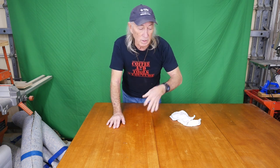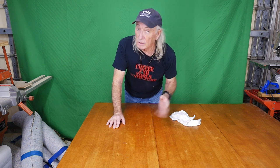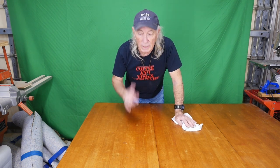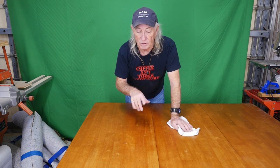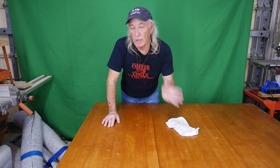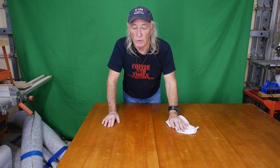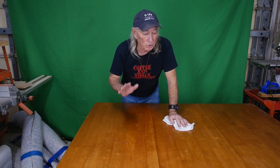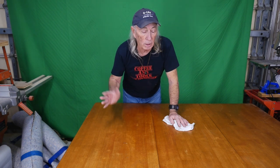There's no reason not to take something like this home, especially if it's free off the side of the road. But if you're at a consignment store or antique store and you don't want to listen to salespeople, those are just basic tips to look at. Look at the top grain and see how the table was constructed out of wood to see if it really indicates solid wood. The biggest thing that always shakes my world is when you go underneath the table and look up and see if it matches what's on top. About 90% of the time it doesn't match, and it tells me right away we've got layers of cores or different materials compiled to create a table. This one here is an excellent example of what a real solid wood table looks like for all the little things we check — legs turned and made the same way.